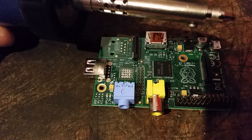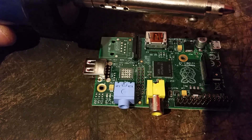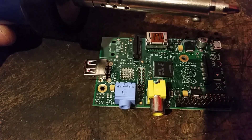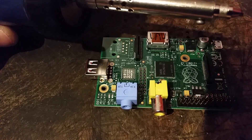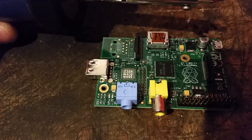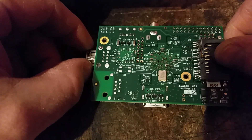There's quite a bit of thermal mass in the tip, so you need to leave it on for quite a while before using it. Check it with some solder to make sure solder melts on the end, but if it's just got up to temperature and melts the solder, give it a bit longer than that to actually heat up. Then I'll turn the board over and try this.